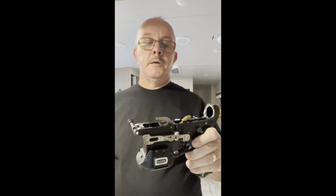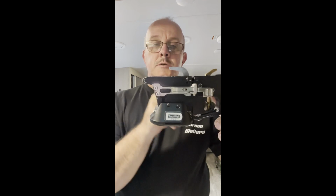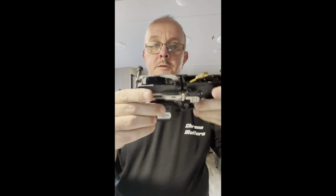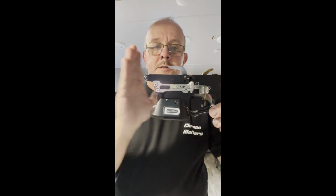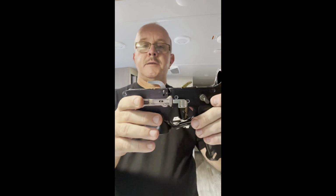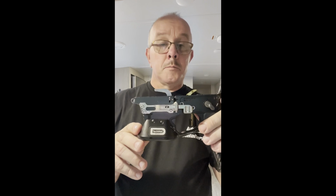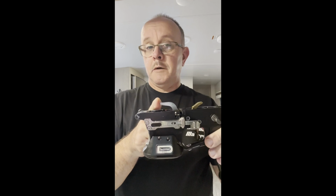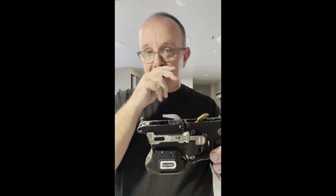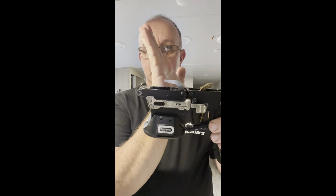The other thing to talk about is this angle. We talked about this already, relative to coming into the breech face to get the case out. This angle right here makes all the difference in terms of the angle that the case comes out at. If you've ever tuned a 1911, you'll be familiar with this. If you haven't, this is a new discussion. Whatever your angle is on your ejector, I would maintain it. If it came from the factory nice and flat, I would maintain that nice and flat. Mine has a cant this way to it. It works really well for mine. I run a Gibbs upper with a small ejection port, and it clears the port just fine. If you start changing this angle, that may create other issues for you that you otherwise don't need.